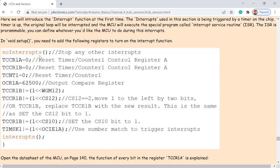So what I want to do is sense it, clear the counter, and then do the display and just hold there. I'm not receiving any data from the sensor anymore. Okay, just do the display. After a while, like 5 minutes, the counter is up. The counter keeps counting, because it's running at 16 megahertz, right? So you know how many counts you need for 5 minutes. It's going to be a lot of counts.